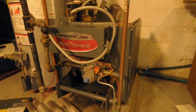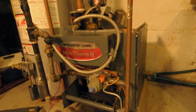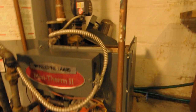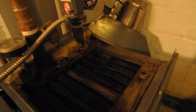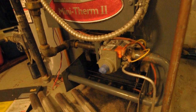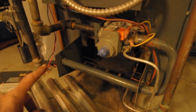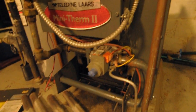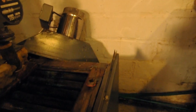Here's how this unit works: you're going to get a call for heat from your thermostat. That's going to go to your logic circuit inside here. It's going to open your vent solenoid over there, then turn on your pump over here to pump water through the heat exchanger. Once those conditions are satisfied and the spark pilot light condition is satisfied, this valve will open up. You'll get a free flow of gas through this rail, this manifold, going into these tubes. Then the heat from the combustion chamber is going to go through this heat exchanger, and the exhaust gas will eventually be collected and sent up through your chimney.